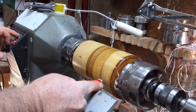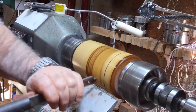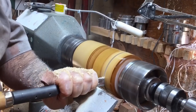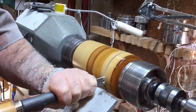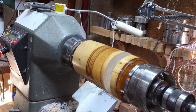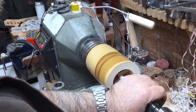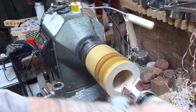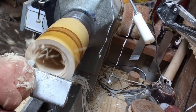I'm connecting the other tenon with another chuck on a revolving chuck, marking it, and then with my new parting tool I'm going to part it — have a look at how easily it parts right into the center. Beautiful! I'm using a 60 millimeter drill and drilling all the way to the bottom, leaving enough space for a heavy bottom, then finishing with the square carbide tool.